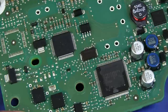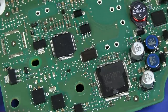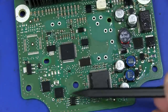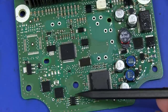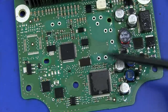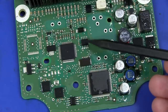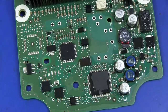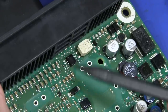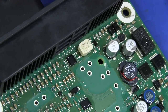The remaining parts on the board are very difficult to find information on, but I did get the E²PROM — that was pretty easy. It's an STM95256 256 kbit E²PROM, so that would be storing the crash data presumably. And this one down in here has got S5051G on it, and I have not been able to find any data on that one — no idea. And that one there — no surprises — that's a CAN bus driver: an Infineon TLE6250G. So they did use some other Infineon parts on here.